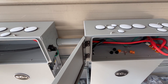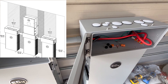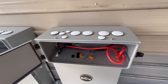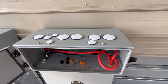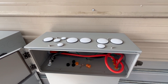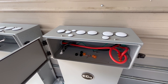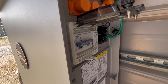Since I talked about the bus bars on these batteries — that works because you're feeding one inverter, the 18K PV, and it can't pull more than these will supply through these wires. If you were going to have two 18K PVs, you wouldn't want three batteries hooked up to a main bus bar sending all that current through just these wires — you'd be pulling too much. This design works through one inverter. You could always feed one battery directly to one of the other inverters. If you had four batteries you could do two and two. The bus bar system just allows people to make fewer runs to the inverters.